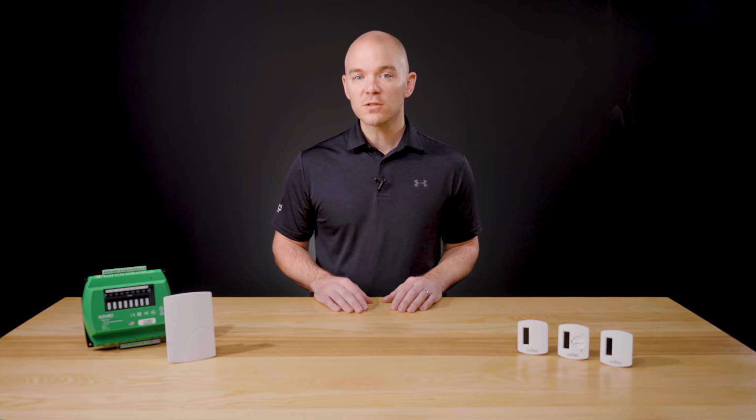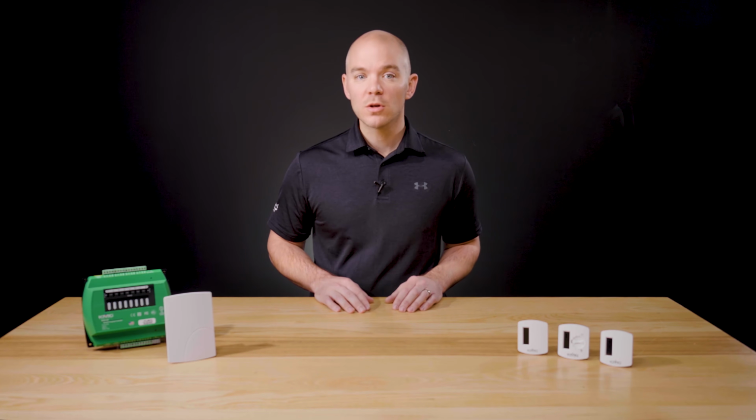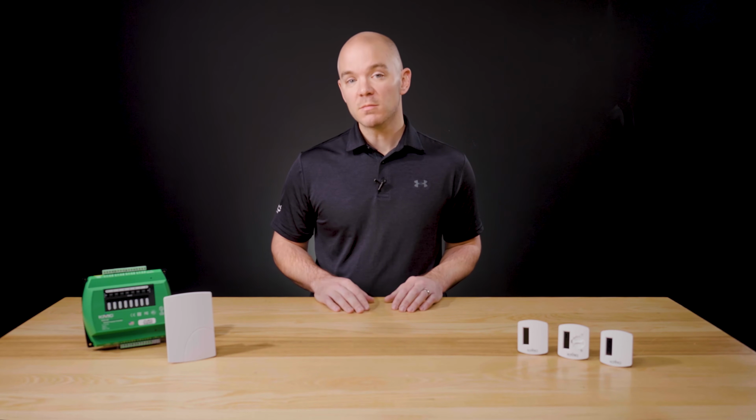The last factor to consider is the shape of the area. Narrow rooms where the sensors and receivers may not be ideally facing each other can cause the range or coverage to be reduced. If the coverage area of signal strength is low, the distance of the sensors and gateways should be reduced, or multiple gateways can be installed.